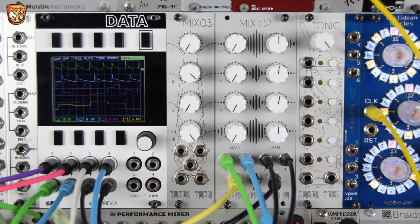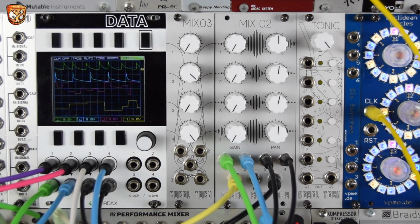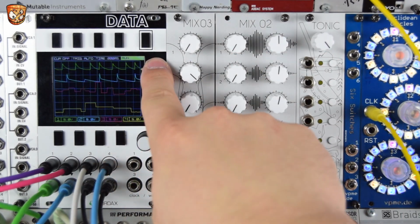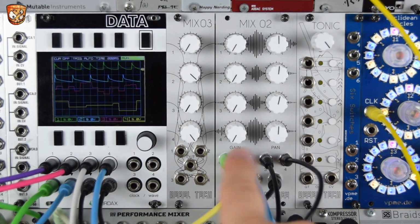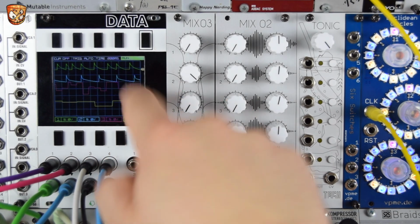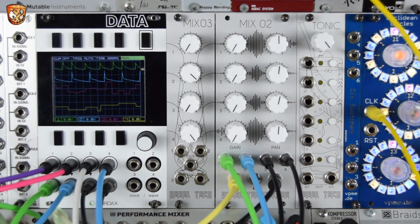And you can hear they're going into some reverb. Now, even though this is panning, we can treat this as a sort of blend to route to A or B, and look at it as not really a matrix mixer, but a sort of 2 output mixer for routing CV. I have 2 envelopes. The top one is this green trace on the Mordax Data to channel 1, blue trace to channel 2, green and blue traces, I even matched the cables. The third channel is a 16th note per step in my sequence, random sample and hold, and a longer every 4 beat sample and hold on channel 4.